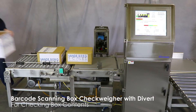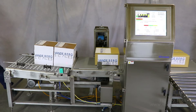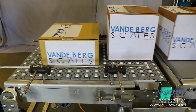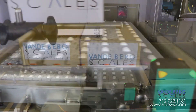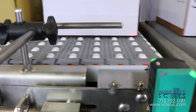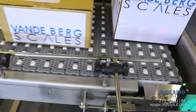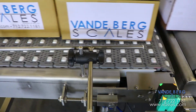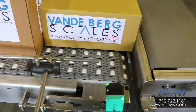Random size boxes are presented to the system from a manual boxing line. The indexer contains two sections. The first section contains a drop-down conveyor that utilizes roller top belting so that the box can remain stationary against the bulkhead as the conveyor travels beneath it without damage to the box. The box is held against the bulkhead until the indexer determines that enough space is available to advance the held-back box.